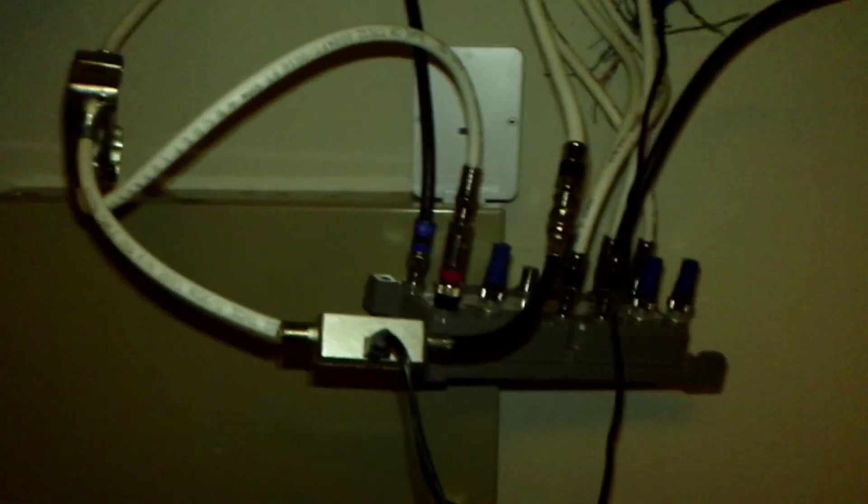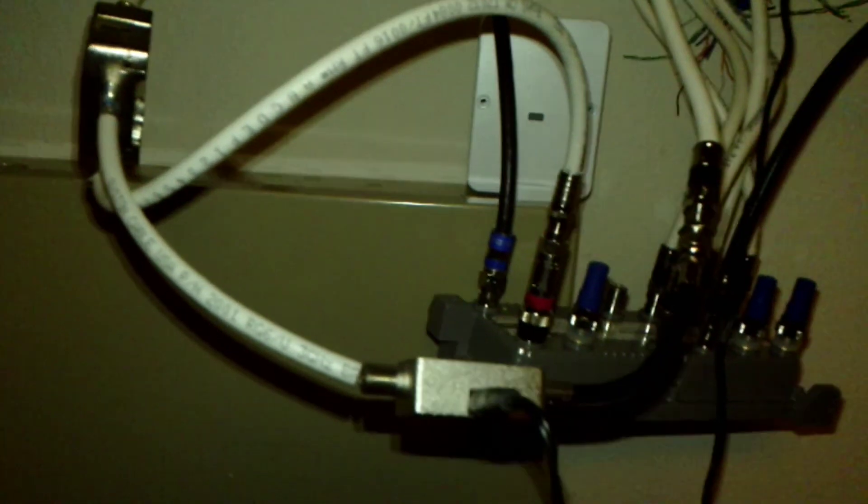Alright guys, I just built a little rough jumper to put in there just to test it. But with this current configuration we have no internet and we have no TV. So the diplexers are a miserable failure. I'm going to break it back down and make sure both work individually and go from there. We're going to install the diplexers at the cable box and under the stairs — completely installed. No cable, no antenna, not super surprising. Why would the cable company want you to get free TV?